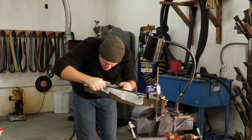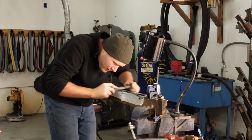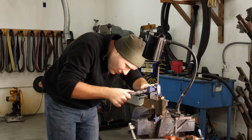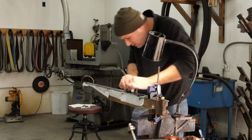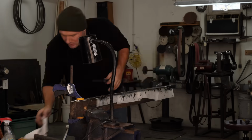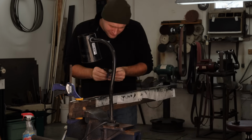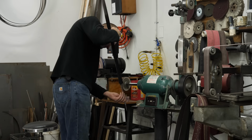The ferric chloride solution eats away one type of steel in our Damascus pattern, the 1084. The 15N20 is the other type of steel, and it has a little bit of nickel in it. The nickel resists the ferric chloride etch and keeps it shiny and bright. Whereas the 1084 turns dark and etches deeper and deeper the longer I keep it in the ferric chloride.